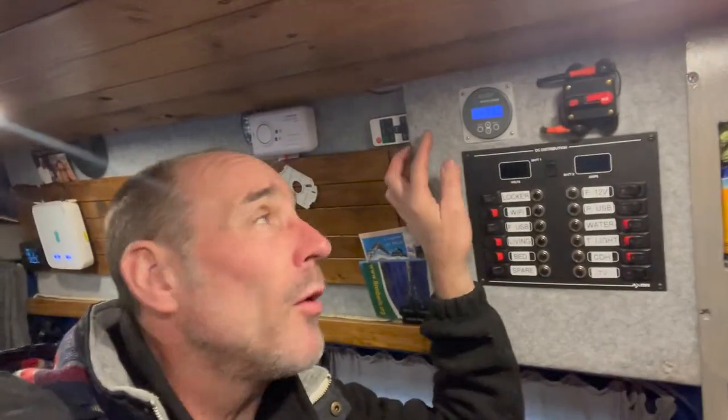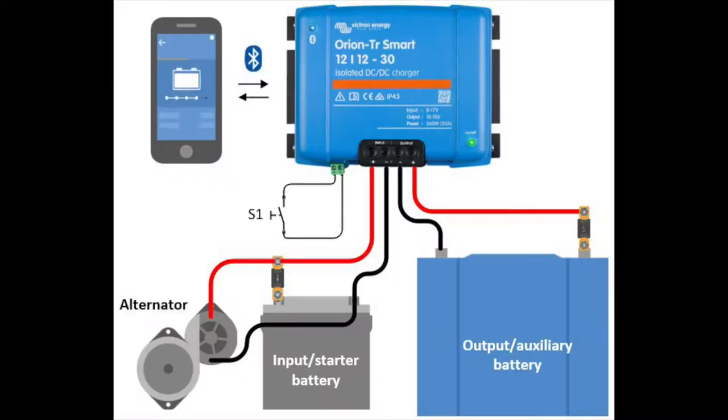Okay, before I do actually take this apart, I'm going to start the engine, because I have a Victron DC to DC charger. So that will replicate the voltage going up, because it's going to charge the battery at the back, and then the relay will click on when it gets to 14.5 volts. And to save you watching this go up gradually, I'll just time-lapse it quickly.